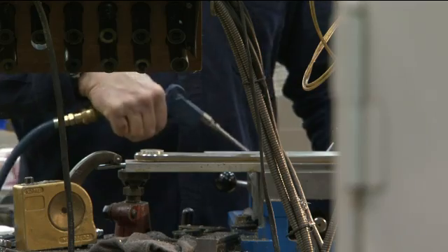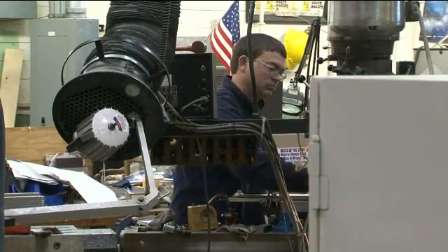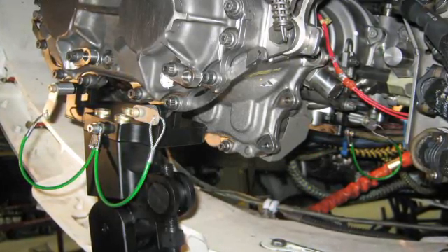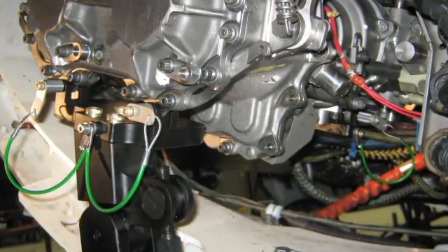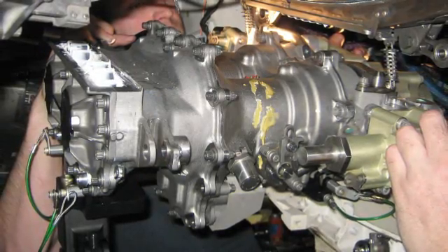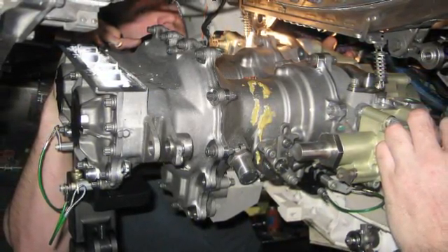If it's taking days to run through a process with JSF and we could come up with a method to save time and money, then we're all for that. We proved it already on BF-1. The change out took approximately three hours to de-install the actuator and to reinstall the new actuator. If they predict three actuator changes, it's going to save three engine pulls.